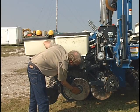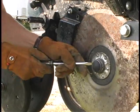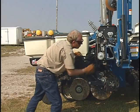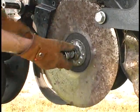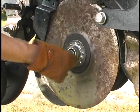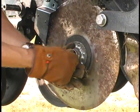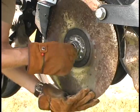Then we'll have basically a dust cover over our bearing here. I'm going to slip that dust cover off to expose a bolt head and loosen that up. I'm working on the right side of the row unit, so these have common right-handed threads. But if I was over on the left side of the seed opener, they actually have left-handed threads there to keep the coulter from loosening up while operating in the field. I'll slip my hand down here because there are some spacer washers that might drop as I take this off.